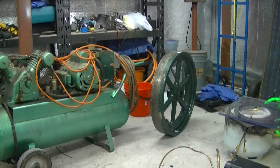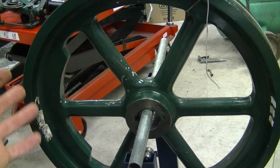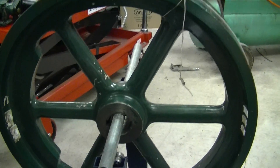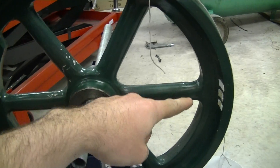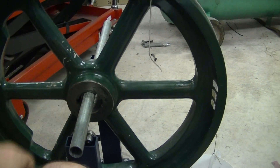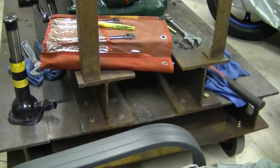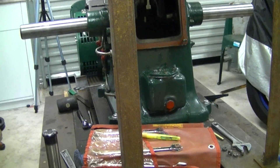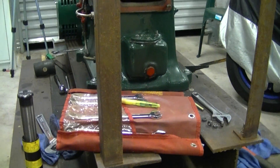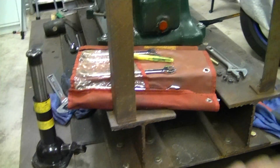Once the flywheels are the same, you can pretty much just add or subtract weight to the opposite side or the weighted side in order to just get it to a smooth point. You start off with a rough amount, like 33% or whatever, and then add more to either side. You want the same offset mass on both flywheels to begin with, and then add the same quantity to each side — otherwise you've got one side banging up and down and the other side's not. This thing had quite a bit of issues with resonance frequency when unbalanced. The whole frame, including the engine, weighs about 500 kilos, but once it starts getting into resonance frequency, the whole thing just starts picking up and we have liftoff. I actually have to jump up on the frame to get it out of that resonance in order for it to stop shaking across the floor.